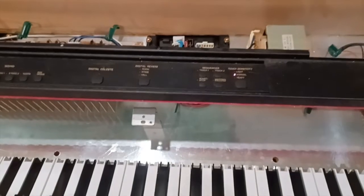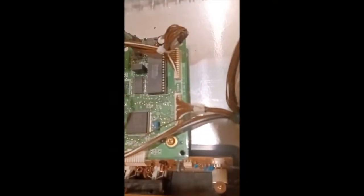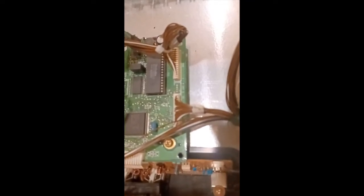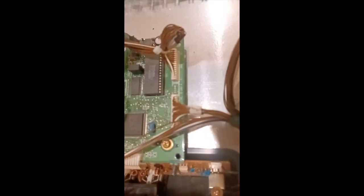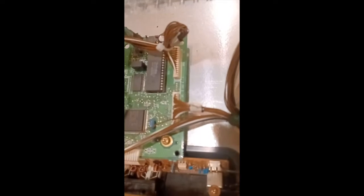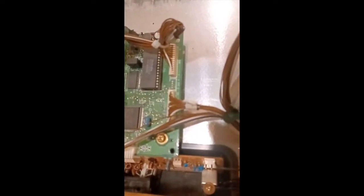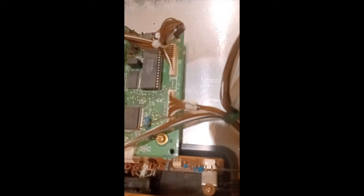And there was the beep. So only one beep means the keyboard ROM is okay. So to make a checking device, we have to put it in those four holes, solder it maybe, or just have pins touching them, unless there is a connector that clips on the side and makes contact with those four pins.